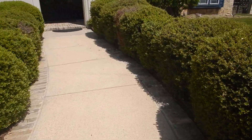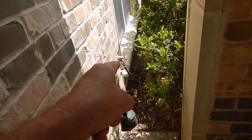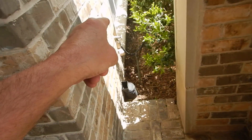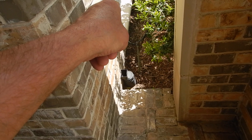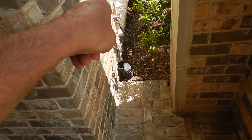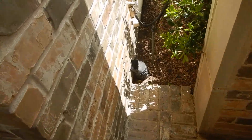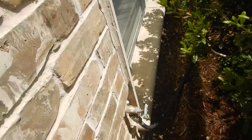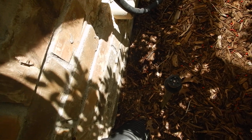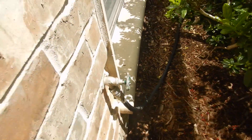Typically what I like to do is check the water pressure at the closest bib faucet to the house. But this hose is attached to the connector in such a fashion that it does not thread and unthread easily, which leads me to believe the threads are probably messed up. I used two pretty good-sized wrenches — can't do it. We are getting a leak at the valve right here, but that's not how we test water pressure.